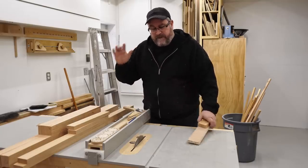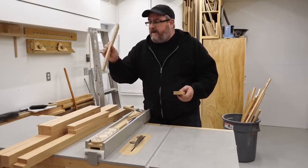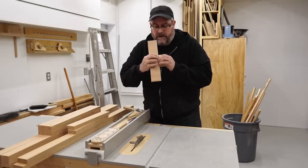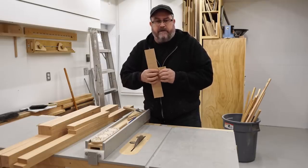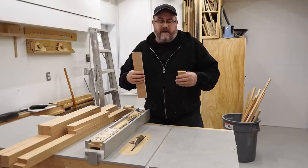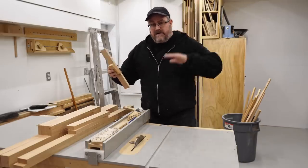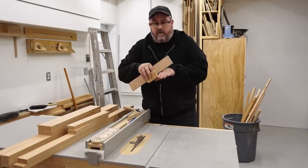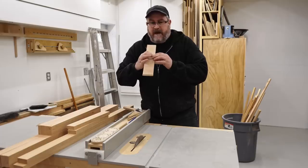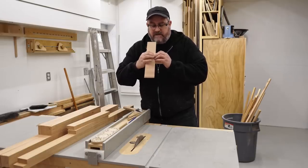Now, think about the panel. It's plywood. I have a scrap of it here, and this is important because I need to make a sample. I want the back of these doors to be flat, especially the one on the bottom, because it swings down and becomes a work surface. So having it set in would be bad. You'd have a lip there that would catch dirt. So I want it to be absolutely flush on the back.